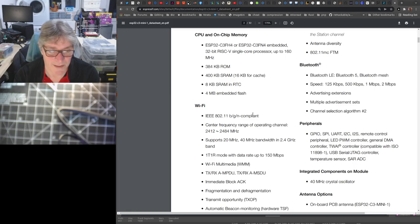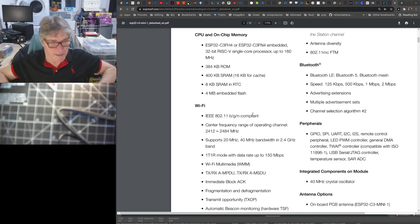Or you could have it indirectly connect to the connected QSPI flash and RAM, although your latencies would go up if it has to go through the FPGA to get to that. But yeah, there are different things that you could do. But it's primarily for connectivity and or being able to script stuff in Python and hack stuff, really, and play around. But that's the purpose of it.